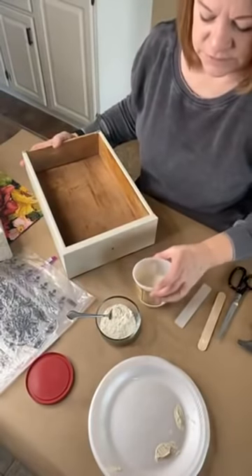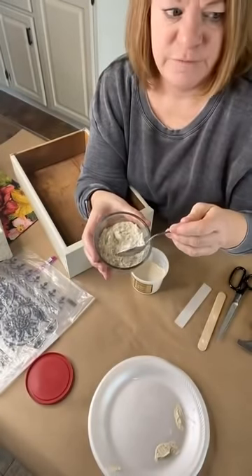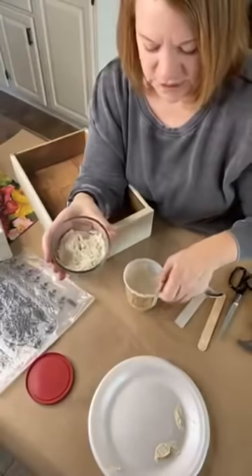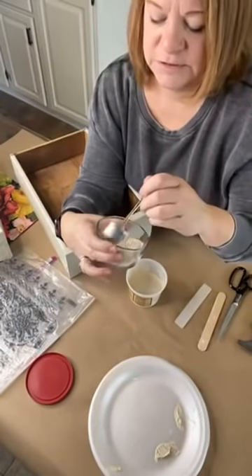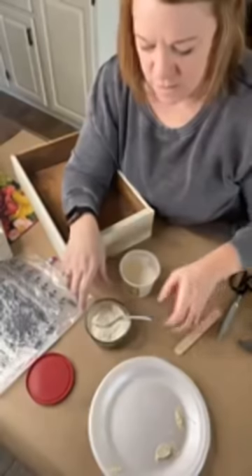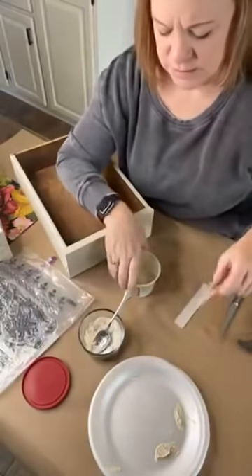So what we're doing: I've got some paint and this is actually powdered putty. It's a mixable putty — like a wood filler. You can fill holes in walls like plaster, and you can find all kinds of powdered putties. I have equal parts powdered putty to equal parts paint, just in a little container. I'm going to put in three parts powder to three parts paint.